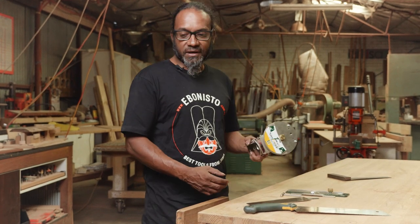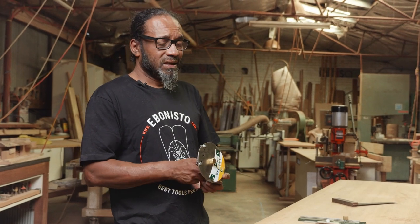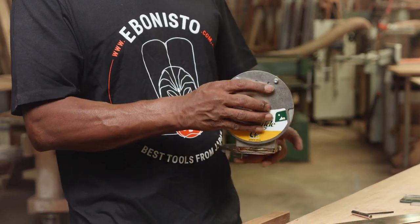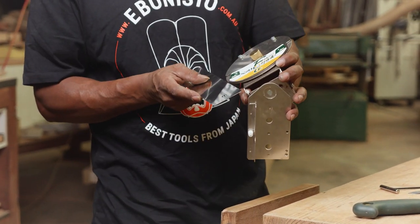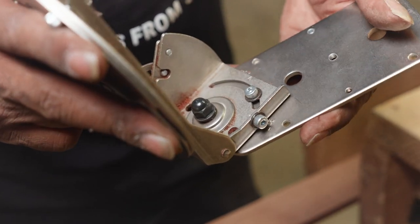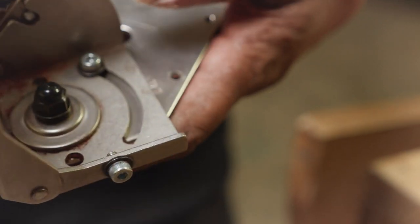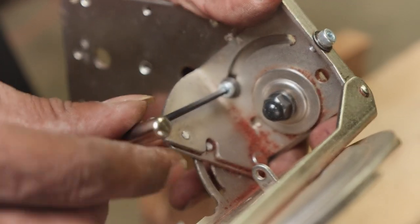The next one is the 45 degree cut. You have to use that when you're mitering skirting boards, picture frames, any situation where you need the 45 degree cut. You can use this to do that very accurately. To do that, you need to set the angle this way using the datum blade. As you can see here, the 90 degrees and the 45 degrees are indexed here — the 45 degrees being the extreme. And once you've got it there, you just use your key to lock it in place.